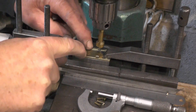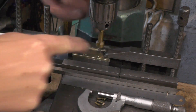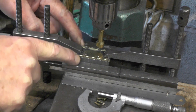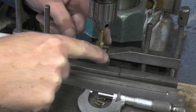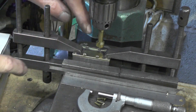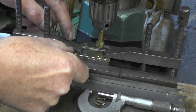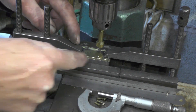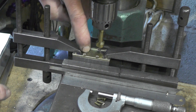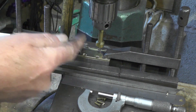Now I've got these first four studs in, or screws in the middle, I can now take these clamps off and countersink the end holes. And once I get them four screws in, while it's in the milling vice and set up, I can take a skim across the face to bring it down to its proper thickness — that's taking one thirty-second off — and then I can put the slot in the top slide where the pin comes through for the vibrating lever.